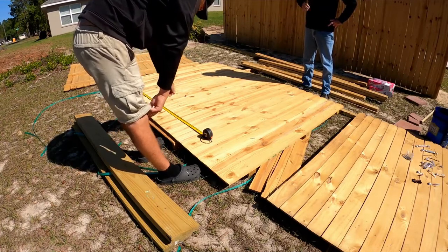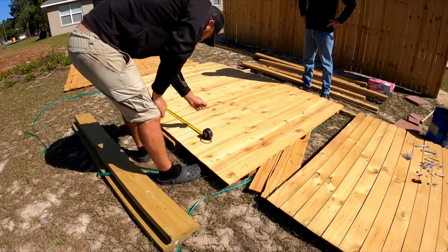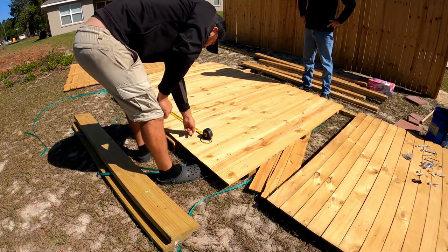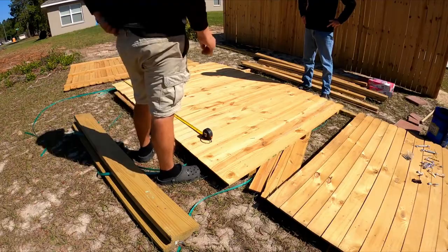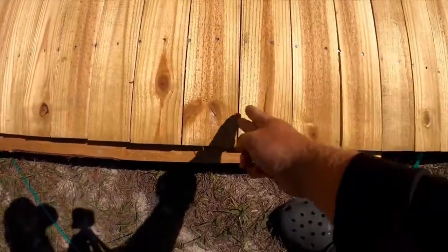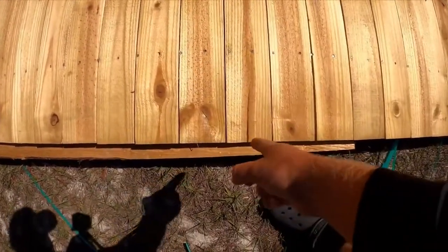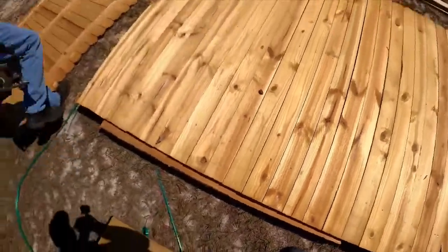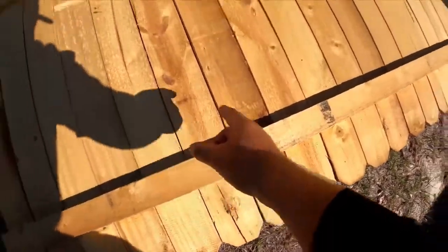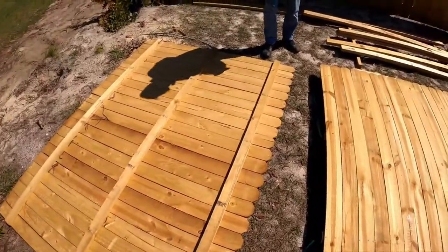But if they're cut down the center, that's going to be an inch too big. So one of them needs to stop at 71 and one of them needs to be cut down the middle. One of them needs to be 1 inch short and one of them needs to be 1 inch big. So we decided, since 72 is like an inch into a seam, we're gonna start at a seam beforehand, which is 71 inches. And then the next panel, we're gonna cut down the middle, so that way we only have 1 cut. So we're gonna cut the 2x4s on the back side of the panel, right where a 71 inch seam. So one of our panels will be 2 inches bigger than the other one.